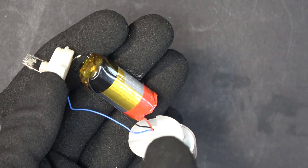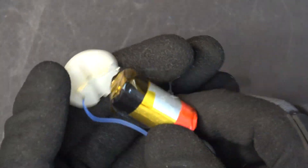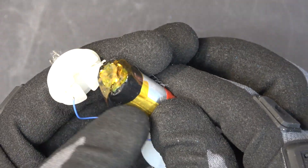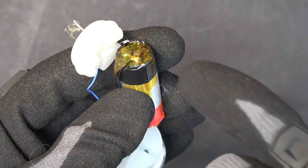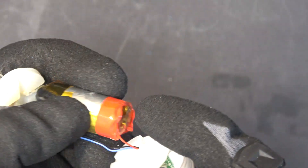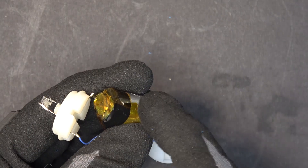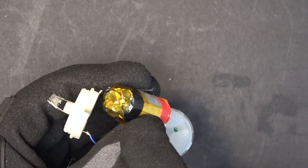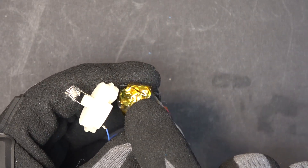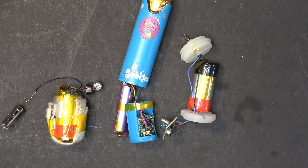The thing about these cells is that even though they are cylindrical, they don't have a solid metal case — the terminal is just a nickel strip, see there, and here on the positive terminal. So you can use it in a battery holder, but you can also just solder the nickel strip on the terminal to your wire. So there you have it — free odd shape lithium-ion batteries that you can pick up out on the street or in the parking lot.